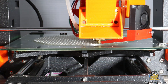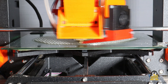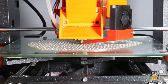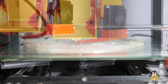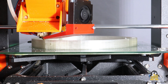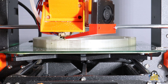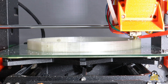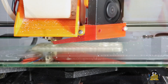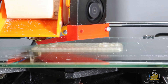The biggest change concerns the feed line of the PLA powder, which now works fully automatic. The largest component that was printed is the lid for the storage container. This component was printed entirely with powder obtained from fresh PLA pellets using an industrial grinding machine. With a diameter of 18cm, this lid occupies most of the print bed area. Other parts include a filling funnel and the base plate for the required electronics.